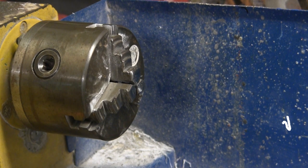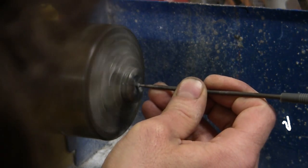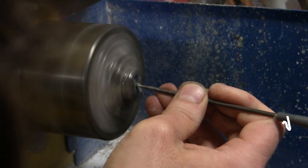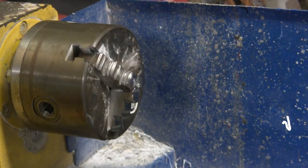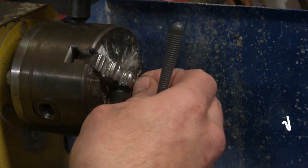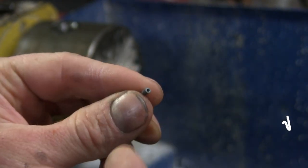This is something you do want to take your time with — if you over-sand or go too fast, the plastic will overheat and melt, causing problems. Use your best judgment and take your time; a little goes a long way. To add the curvature, I'll use a round needle file — standard in every needle file set. Since it's cylindrical and conical in shape, when the headstock is spinning it will remove material only where it makes contact, giving you the natural funnel shape required for this piece. That's really all there is to it — the procedure goes by pretty quickly.